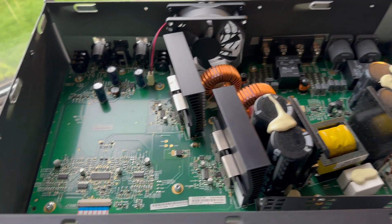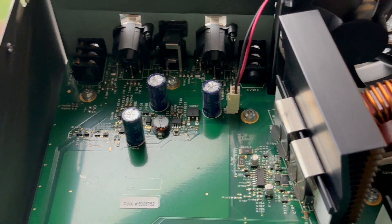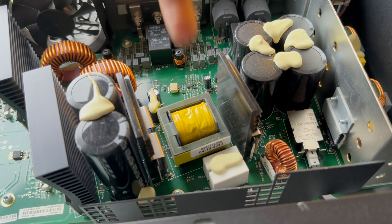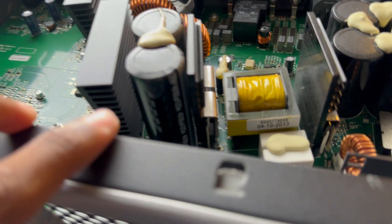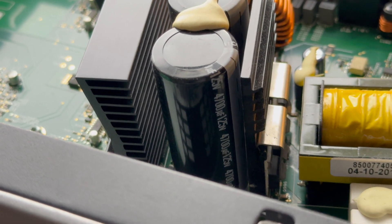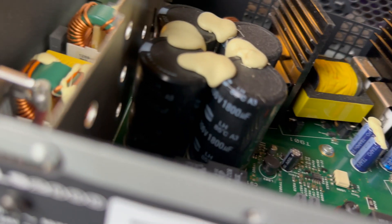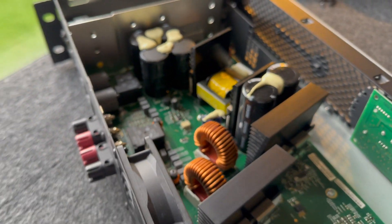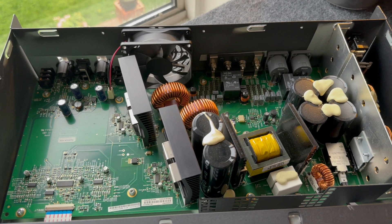As you can see, it's very minimal. The board solder quality is very high — even for a budget amplifier, everything is very clean. You've got your two channels, your rails, and the transformer is remarkably small. Your power supply caps are there. On the rails we have 125-volt caps — two of them at 4,700 microfarads. On the power supply side there are 200-volt, 1,800-microfarad caps and there are four of them. Overall the inside is very clean and, for something budget, put together really well.